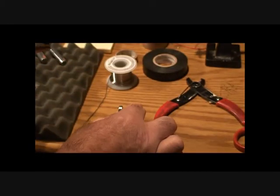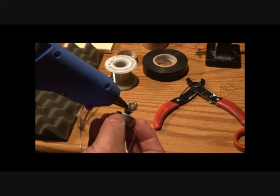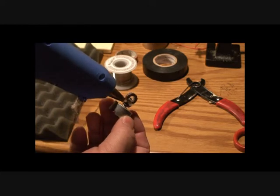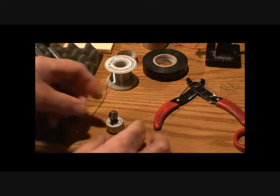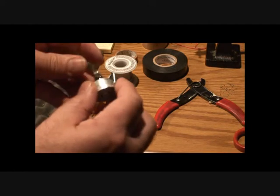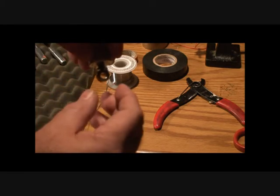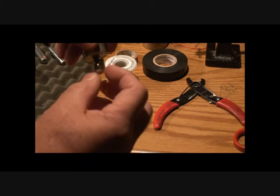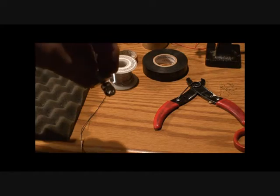That's really the basic component of the EM pump. After it's mounted, really secure it — this thing is going to be spinning at high speed, and if you drop it there's a good chance you can pop the magnet loose. Just put enough hot glue on there to hold it on, and be careful not to burn your fingers. Also, make sure your hot glue doesn't get on the spindle itself, because it will stop the motor from spinning — keep the glue just on the mount and the magnet. It takes a minute or two to dry.